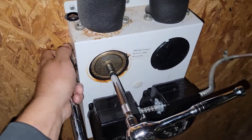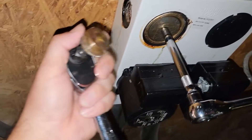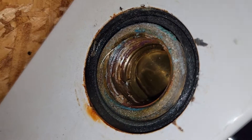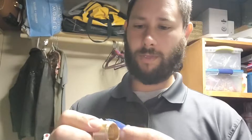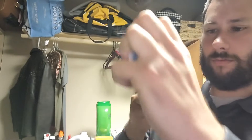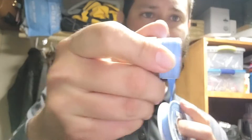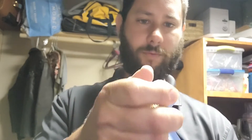That's the connection right there — see how that valve is in the closed position. Making sure that I get plenty of Teflon tape. Try to at least go around the pipe three times. Make sure it's in the direction that you're going to be tightening — four or five times around is good.